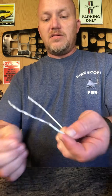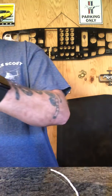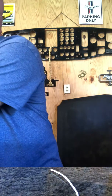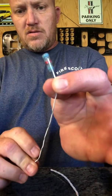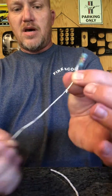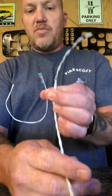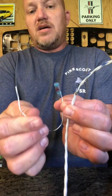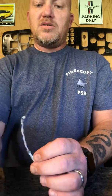Make it nice and neat. Then you take your solder sleeve. Solder sleeves come in many different forms. The most common for twisted pair has a ground coming off so you can still use your outer braiding — it's now technically a wire or a ground.